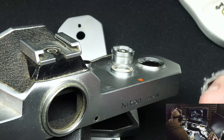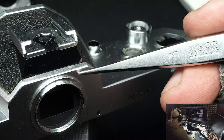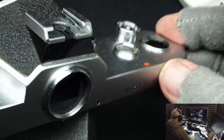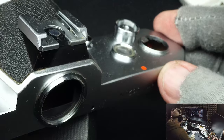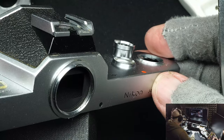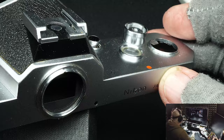The crud on this camera, as bad as it looks, about nine out of ten cameras I get in look like that and I clean them up. It takes about an hour, using a degreaser like 409, naphtha, or alcohol. I test different areas with different cleaners to find out which works best on that particular camera, because you never really know what caused it — whether it's rust or oil from fingers.